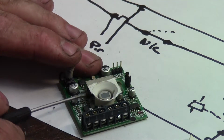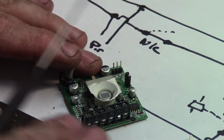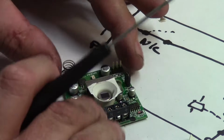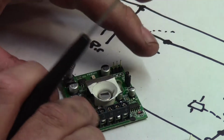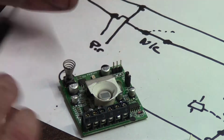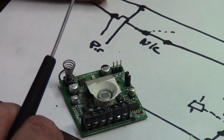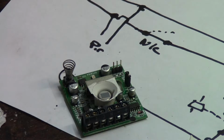So we need to figure out how to interface either this one or one that's got a transistor-based switch on it to operate the remote control by inverting the logic. That'll mean if the sensor goes faulty, they can just go and swap it out like for like, and they don't have to worry about figuring out modifying it and soldering it and that, because that's not really an alarm tech job description. So let me get another piece of paper and then I'll show you what my plans are.